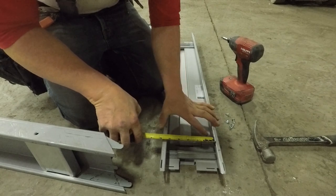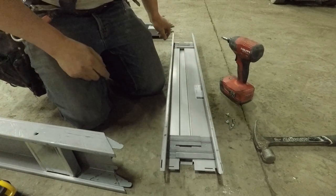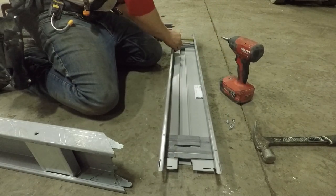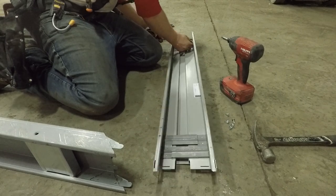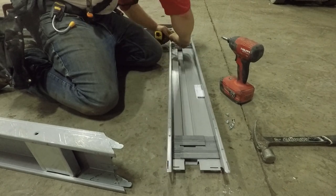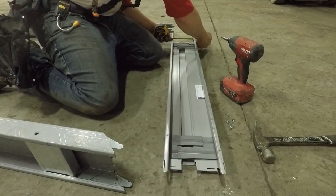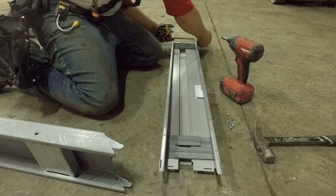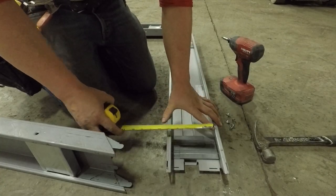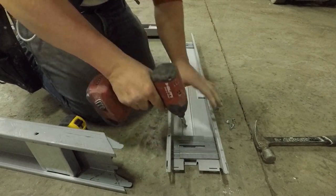Here I'm going to show you how to build these frames. It's not that hard, guys. If you're watching this video, you're probably doing pre-research to see how easy it really is. All you've got to do is know the right size. For three-and-five-eighths with five-eighths, one-hour wall — type X — you're going to want to set the opening size to four-and-seven-eighths.